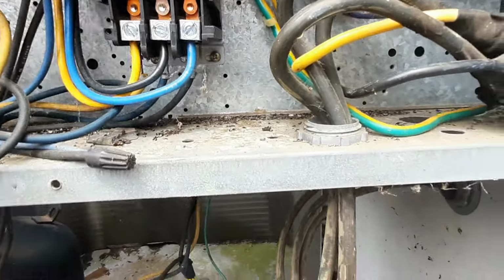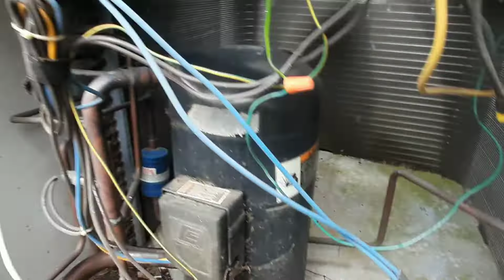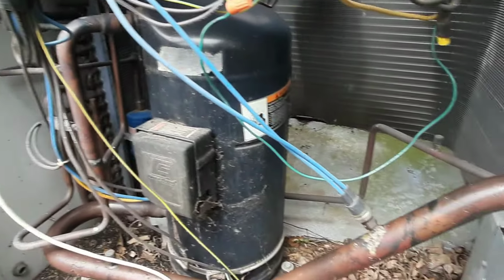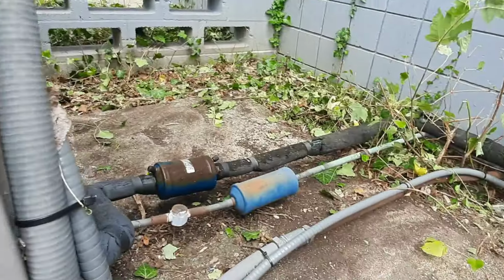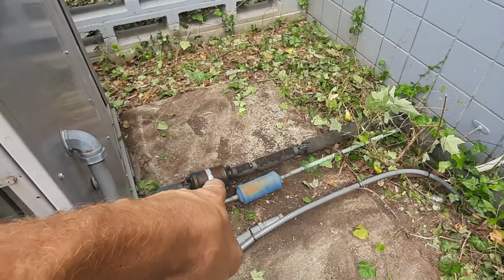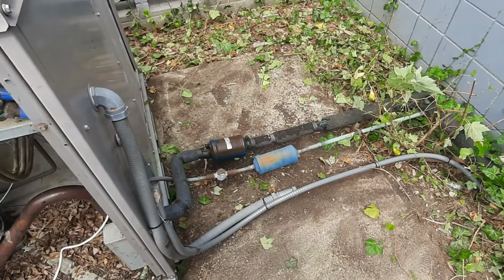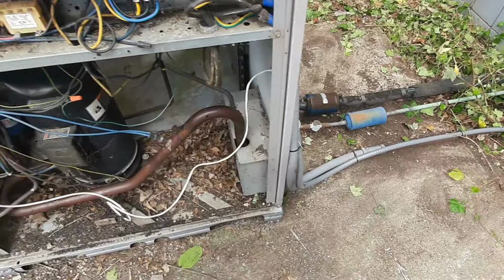This contactor was also replaced in 2019. So I don't expect the coil to be too bad. We just wanna make sure, get everything as good as we can and don't have to come back. We're double filter dryer too. There's the factory and then there's the other one. The other unit, I didn't notice that. I noticed the suction line dryer. Guessing they had burnouts at some point, but there's also liquid line dryers inside at the air handler that I noticed because it was flare.